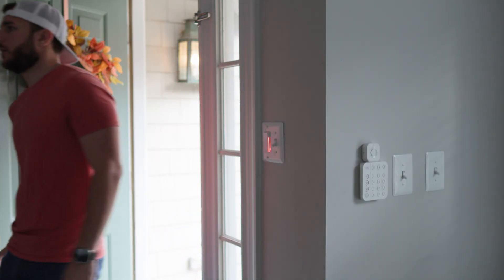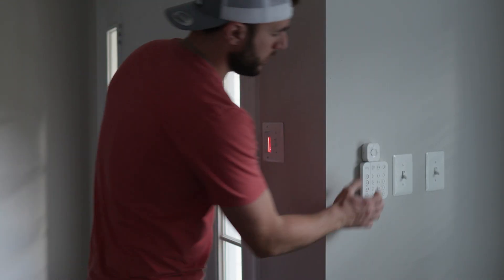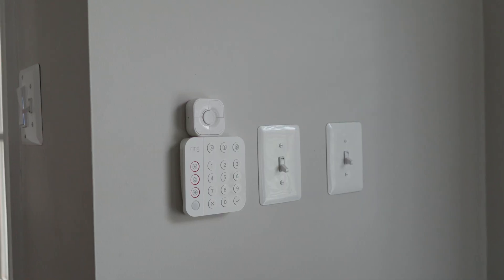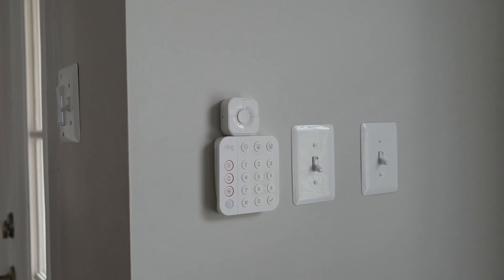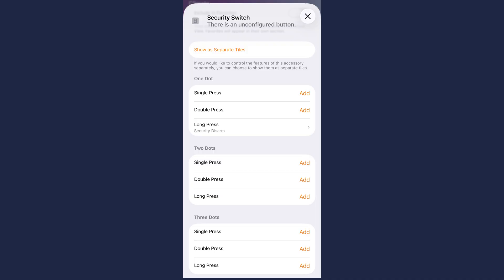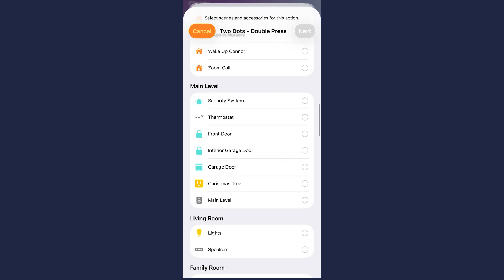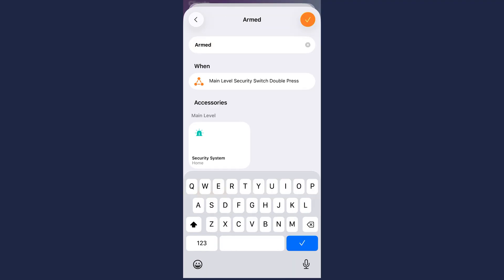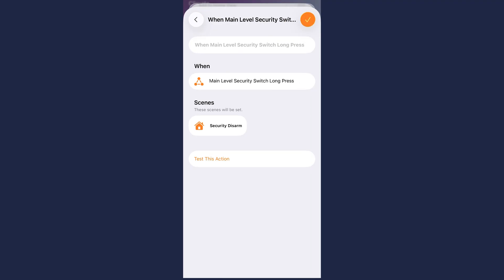What about local control? You'll want to disarm the system pretty quickly when coming inside. I haven't solved for a password-protected disarm, but the disarm can be hidden among buttons, or the button itself could be hidden. I set up this Onvis 5-Key scene controller, which is HomeKit over Thread. I've mapped the different security states to the buttons and tried not to make it super obvious. Double tapping one button triggers Home Armed, double tapping another triggers Away Armed, etc. Pressing and holding a button disarms the alarm. This button configuration still allows single press of all five buttons for something else, like turning the lights on in the room. Just be careful not to accidentally arm your security system when you don't want to.